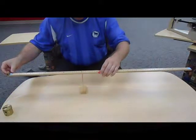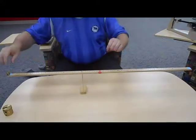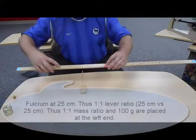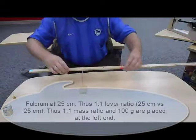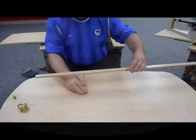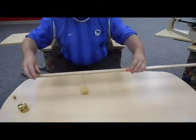For the board to balance, the torques on the left and on the right must balance each other. Thus each must have a torque that equals mass times gravity times lever arm. The lever arm to the weights is obvious. The board's lever arm is measured from the pivot to its center of mass. The measured masses match the computed masses.